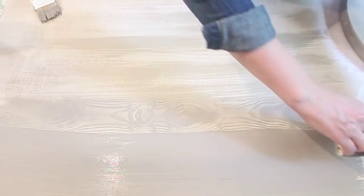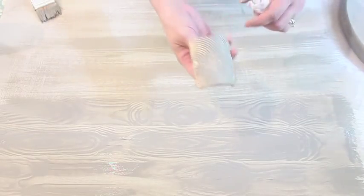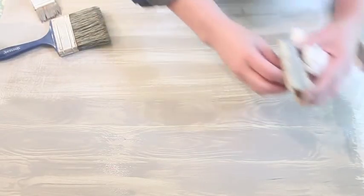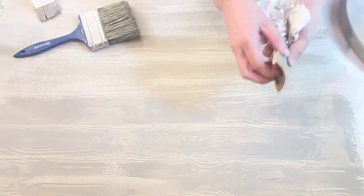On the next row I like to reverse my rocker. You can see it's leaving a really pretty wood grain. If you don't want any knots you can just scrape along the teeth. As a final step I like to take a dry brush and very lightly feather the grain in. If you do too much that's okay — just roll back over it. In the end you want to wipe off all the excess paint in between your stripes.